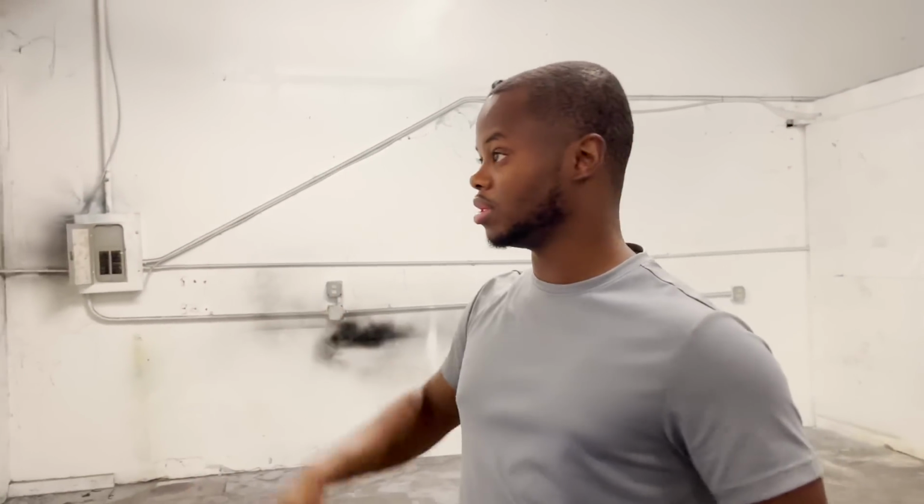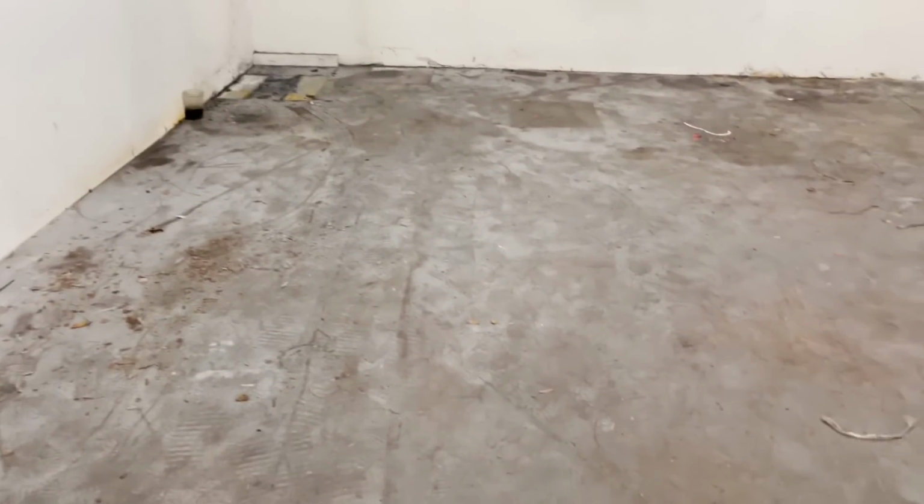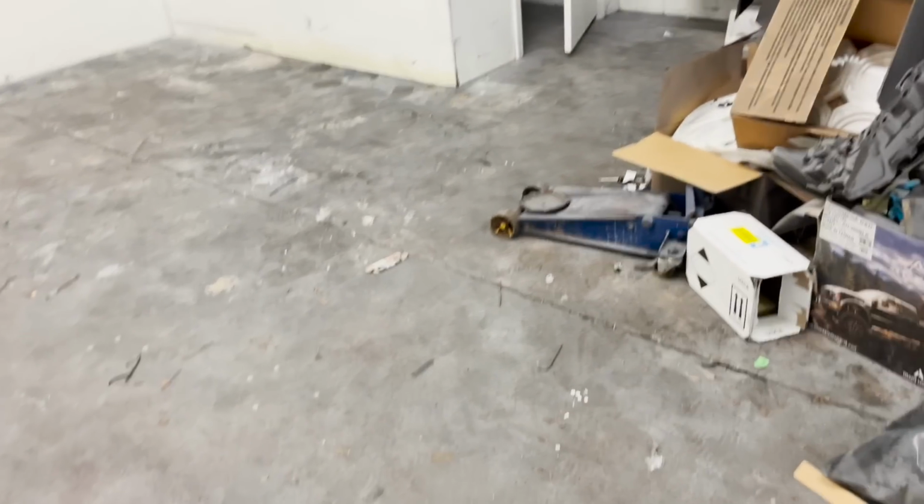Yeah, so once the wall's clean, we're gonna go on here. Like I said, we're gonna spray them. All right, then the wall's clean, painted. We're coming with a diamond grit with the floor buffer, and we're gonna grind this whole top layer of the concrete. Get it clean as we can after squeegeeing, getting all this overspray, primer, all kinds of stains off the floor. We're gonna grind this for a couple of hours. Once the floor gets cleaned up, we're gonna mop it with mineral spirits, acid, get as much as we can.